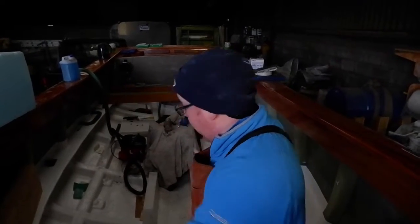Now guys, before I actually go on and discuss what I was doing with the diesel tank before, i.e. our thoughts and processes of where we were going to actually put the tank, I had actually forgot my basic stability rule. Always lay it down the centre of the keel and always lay a minimum out for the edge.